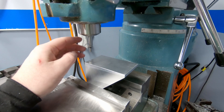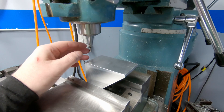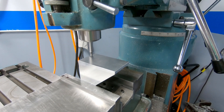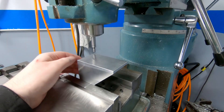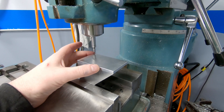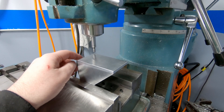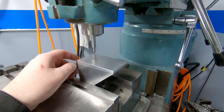Now I'm going to use my edge finder to line up the rotating axis of the mill head to this corner of the part. That gives me a good zero reference so I know where I'm at in relationship to the center line of the mill, the part, and the dimensions I'm going to be using for the cuts. I've got the zero point set to this corner of the part and the dials on the horizontal axis zeroed. If you're curious about the proper way to use an edge finder, I've made a video about that and will leave a link in the description below.